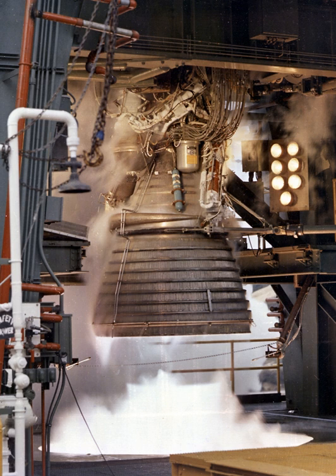While work on the J-2S continued, NASA also funded a design effort to use the J-2S turbo machinery and plumbing with a toroidal combustion chamber and a new aerospike nozzle to improve performance even further. Two versions were built: the J-2T-200K that provided 890 kN (200,000 lbf) of thrust, allowing it to be dropped into the existing S-2 and S-IVB stages, and the J-2T-250K of 1,100 kN (250,000 lbf). Like the J-2S, work on the J-2T had progressed to a lengthy series of ground-based test runs, but further development ended in the post-Apollo drawdown.